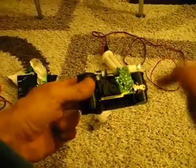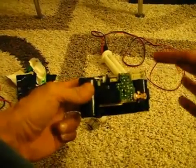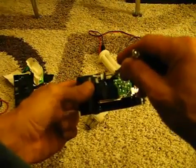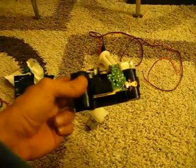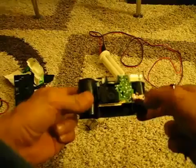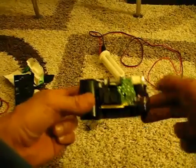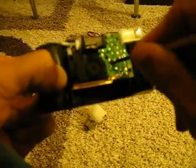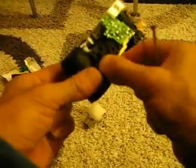Now the important part here is try not to go anywhere near these flash units. First off, push the tabs together in case there's any charge in the flash. Sometimes they'll flash, sometimes they don't — depends if you've pressed that button at all, because that's what charges it up. Now fold that out of the way. This small black tab here, you want to press that in, so then the circuit board should just lift away from the camera. That's the only part you're interested in. Just throw all the rest away.